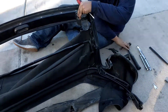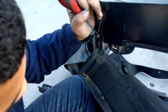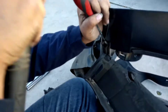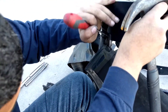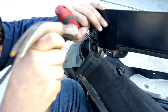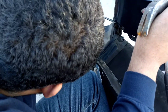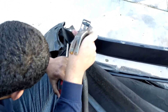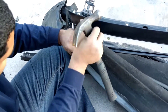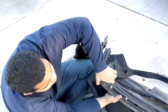Come over here, let's show them some of this rivet smashing action. Take your screwdriver, line it right up at the top of your rivet and just hit it. Once you break that little bit off, you tuck right up under that rivet and you can just start busting it away. Eventually you'll end up shearing the whole entire head of the rivet off — and if you're like me it'll fall down a little hole. Once you do all of that, you can smash the front of the rivet and it'll start to pop out. The little piece that's riveted on will slip off and then you can run it through the top.